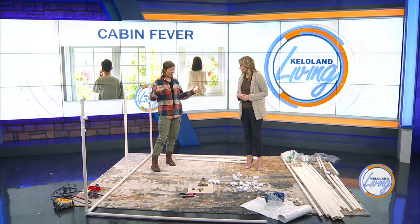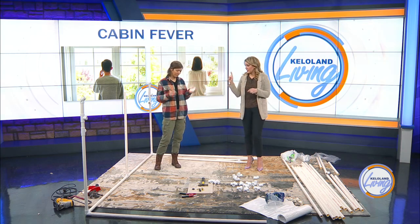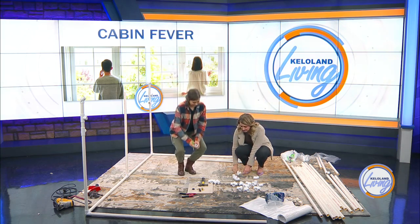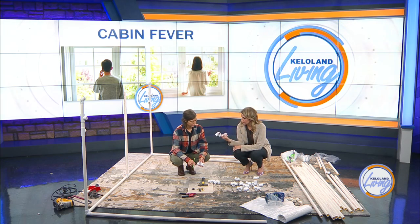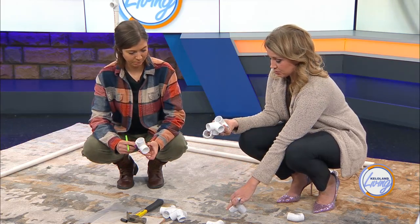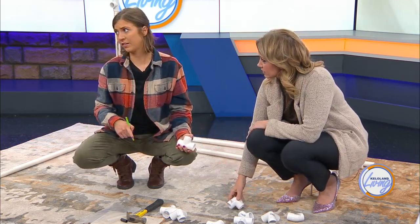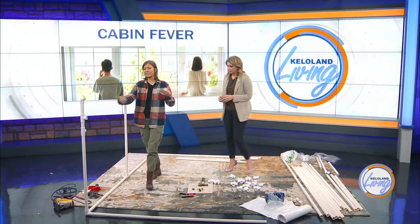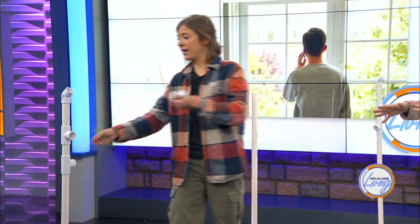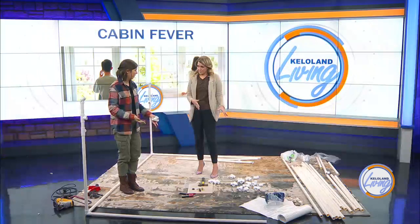Starting with a rough draft and some general measurements is the perfect place to start. It's not that hard to cut this stuff — cut it long, then check if it's going to be level, and if not, cut a little bit off. For the roof, you're going to need 45-degree angle fittings, a lot of T's, and a couple of four-way fittings. One thing I really appreciate about your design is you made do with the fittings you could find. Where the roof's going to be, there wasn't a perfect fitting, but we can measure and cut and add some lateral bracing and go up for our peak. If you find these basic ones, you can totally make it work.